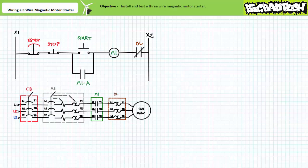Additionally, this circuit should exhibit similar behavior if the motor ever entered overload conditions and the overload element was given a chance to cool and reset. The system should not automatically restart until an operator makes the conscious decision to do so. Three-wire control circuits like this one are commonly used in scenarios where the sudden unexpected starting of the motor driven load may damage the system or operator.